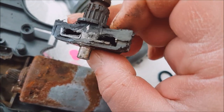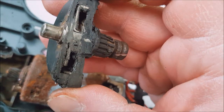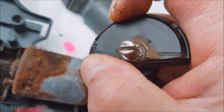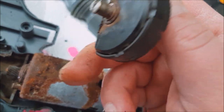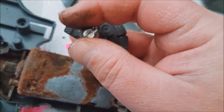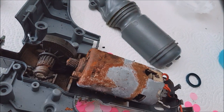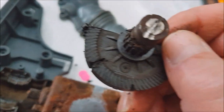The torque limiter and clutch was also found to be penetrated by water and completely solid — it will not spin under any load. Its overload protection function is completely lost. If the bearings are seized, the pinion will try to drive through the overload plastic gears. It's steel against plastic — we know who wins — and the result is precisely that the plastic has been machined quite thoroughly.